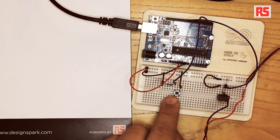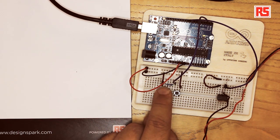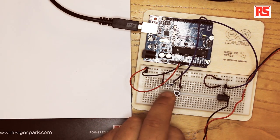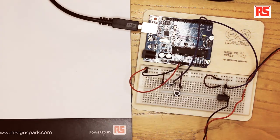Let's look at the sensor part of the circuit. In our case the sensor is a button, wired up in the usual way. We have the button and a pull-down resistor — power connects to the button, then button to resistor to ground. The point where the button and resistor connect is where we take the voltage and bring it to pin number 2 on the Arduino.